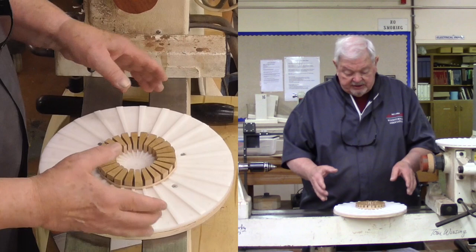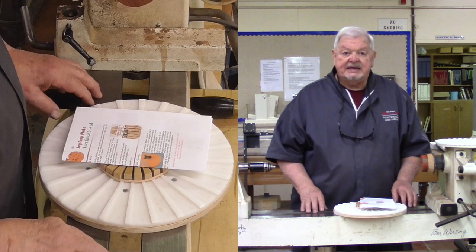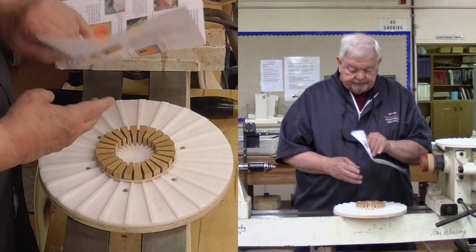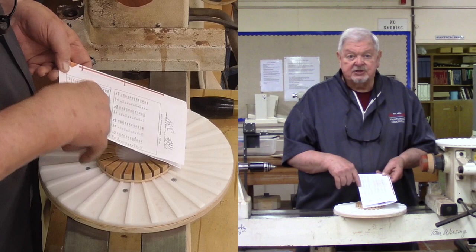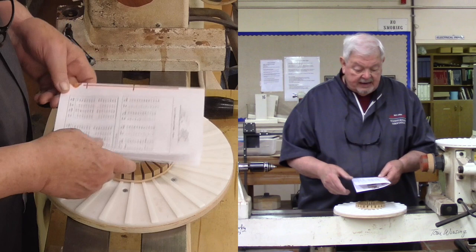So the next layer, you cut the pieces, put them in the plate, and so on. So what angles? What's the segment edge length for each of these plates? And you buy these from segeasy.com. The link is down in the description below the video. You will also be able to download a piece like this. Here's the process for using it. And here is a table showing, for whatever diameter you want for this particular plate, what the segment edge length would be, in eighths of an inch, from 4 inches all the way up to the maximum of the plate. So you buy the plate, you download this cut sheet, and that gives you the segment edge length.